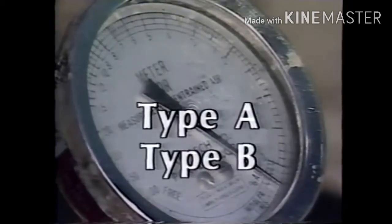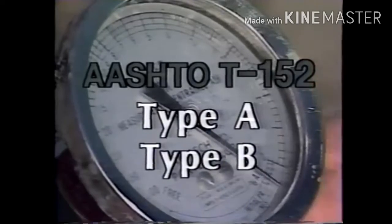The most popular method for measuring air content is the pressure method. Two types of pressure meters are available and are widely used. They are referred to as Type A and Type B, and are covered in AASHTO T152.